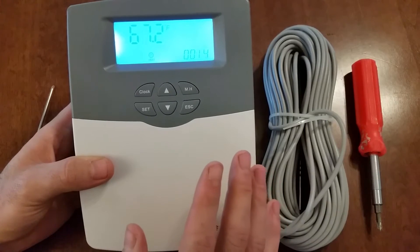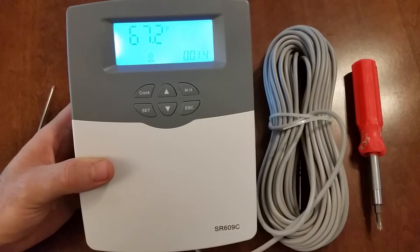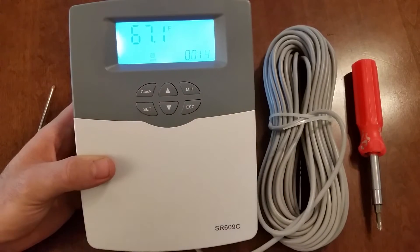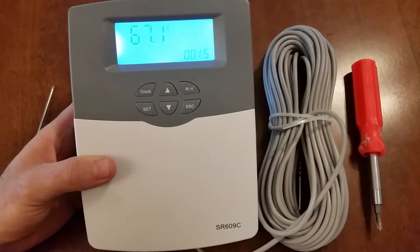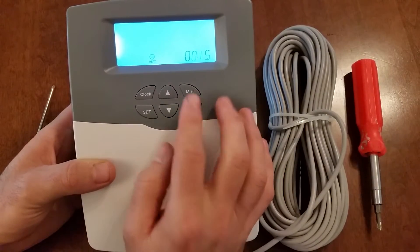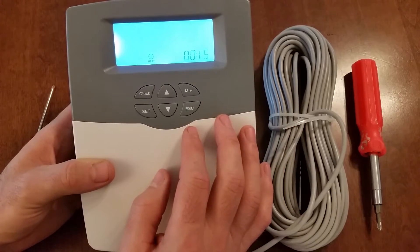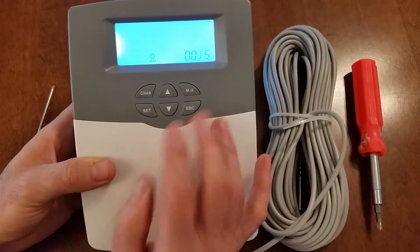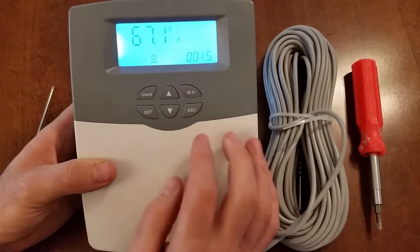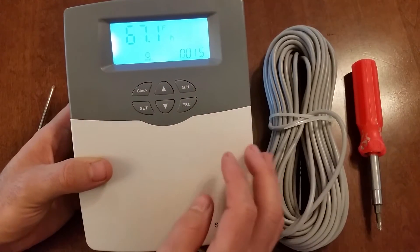There are a few functions in here, only a couple of which we'll need to know about. We'll start with heating. The first thing to know is there are two different heating functions. There's the MH button, which is manual heating — that's a one-time heating. If you aren't using electricity, you're just using solar, and you want to get it up to temperature once, you'll set that, hit manual heating, and set it to — let's say — 140 in this example. That could be an anti-Legionnaires function. You can see the manual heating is set and it's going to heat the tank up to 140. But you're really not going to use that that often.